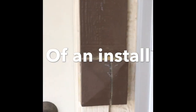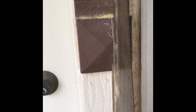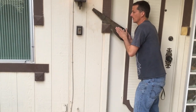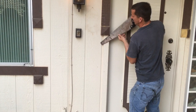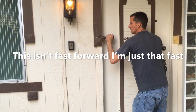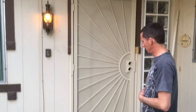This is my mom's house and I figured this was going to be nice and easy - didn't realize that trim was here. I'm not using the best tools right now, but basically I just used a handsaw and went straight up that edge, then cut a diagonal angle all the way to my cut line, came in the other way all the way to the cut, and I'm just going to finish it off with a heavy-duty putty knife to snap it off.